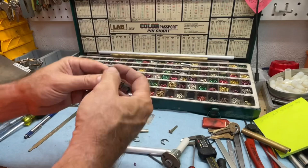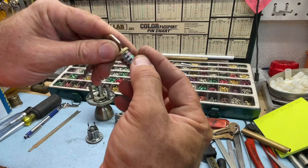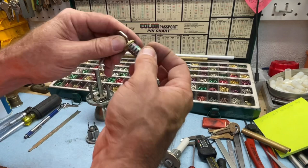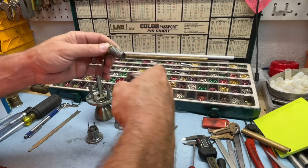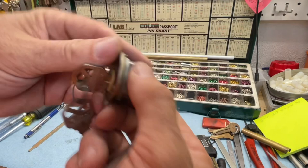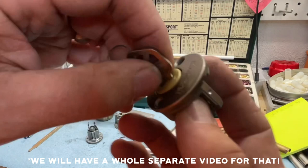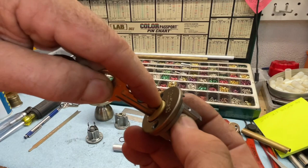What we had for six, so that's 285. Two — now I have not mentioned MAC yet. That's this number right here: MAC five. That is Maximum Adjacent Cut — you can't have a really high cut next to a really deep cut or a really shallow cut next to a really deep cut. I have definitely done a video on MAC. When you put this back in, turn it a couple of times — get in the habit, you're going to be doing this forever. Push your fingers up against the plug because you don't have a clip yet. If you pull it out right now, all your top pins and springs are going to pop out. So push your finger up against this just like that until it comes out — make sure to do that always, otherwise you'll pull out the plug and have to redo everything.